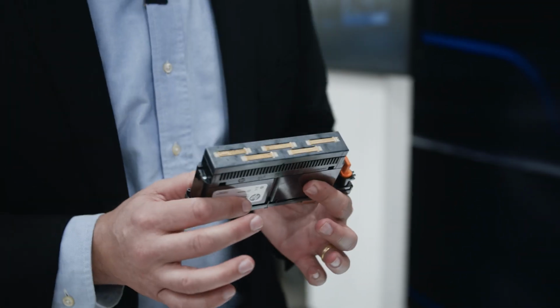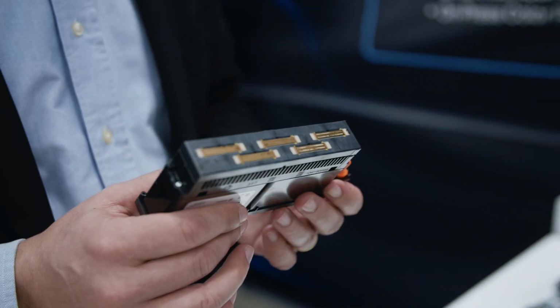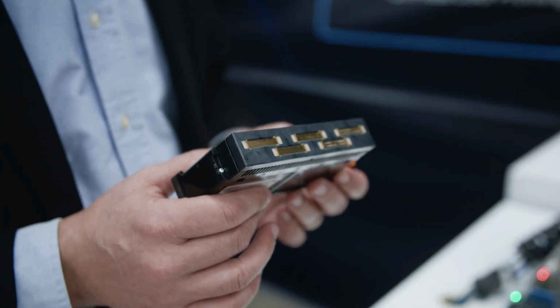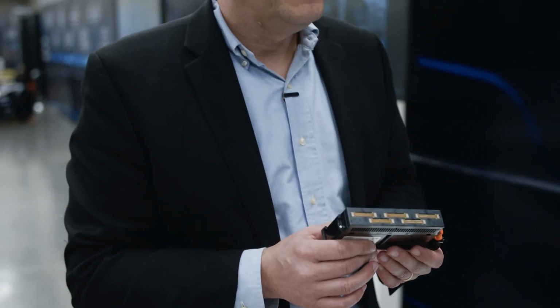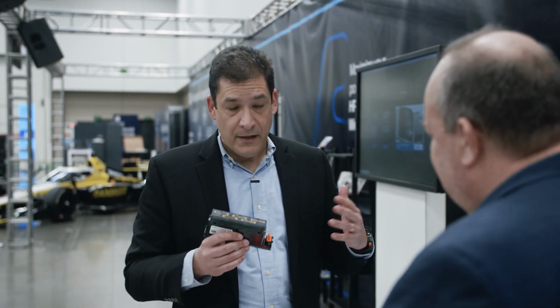And how fast does that have to jet in order to make sure that you get something on paper? Because I think with the upgrade pack, the 2200 runs 800 feet per minute in full color, right? Right. So it can run up to 800 feet per minute, but on the larger ones, the T400s, they run at 1,000 feet per minute, which is about 305 meters per minute. So it's incredibly fast. We're talking billions of drops, right? Well, millions of drops per second.